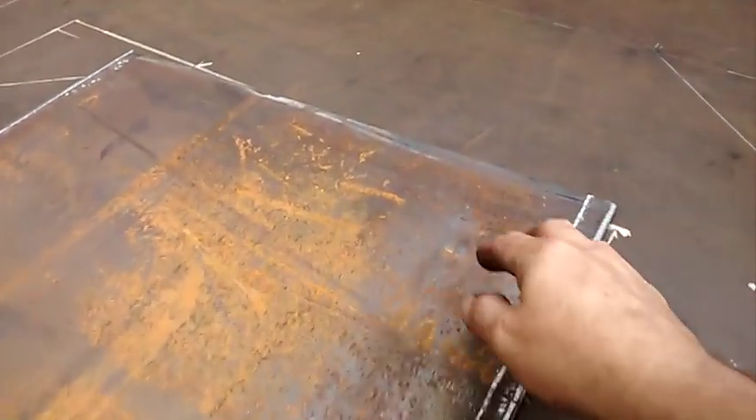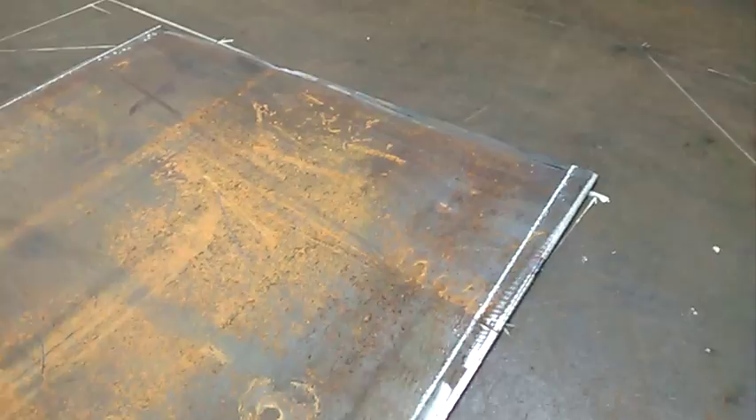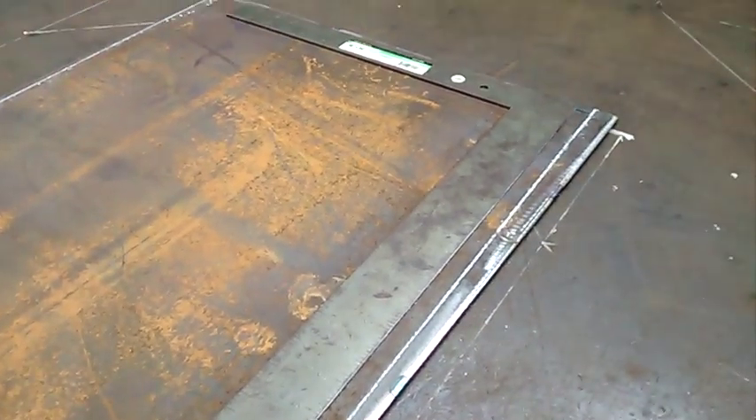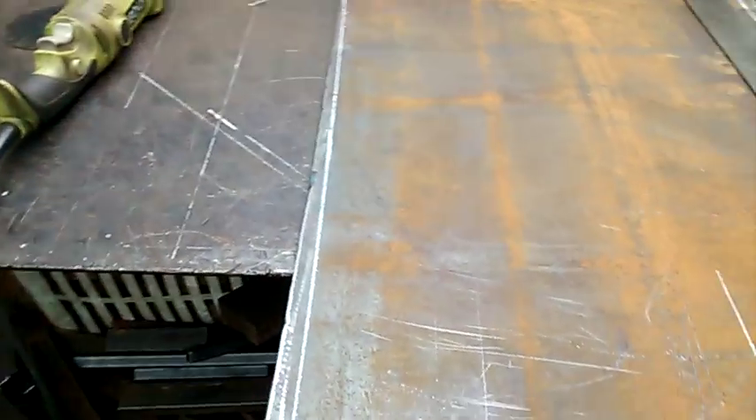It's a horrible mistake. If you're trying to build a vertical smoker, a box, or anything with a bunch of square or rectangle panels, take the time to square it diagonally. The marks I got on there I did with the framing square - there's a factory edge on this side, so I just used the framing square to come off of it and get my mark. That tip right there is going to save you a lot of trouble. You'll get lucky 99% of the time, but that one time is usually going to happen when you're in a hurry.